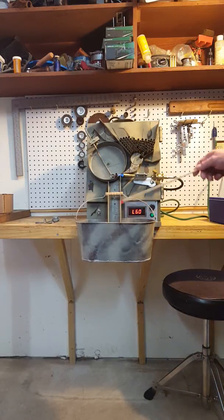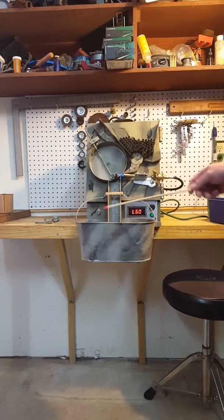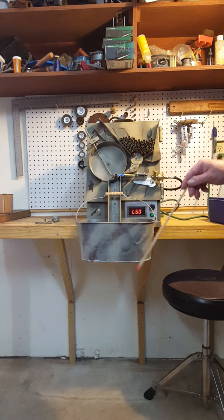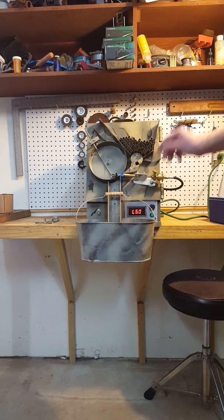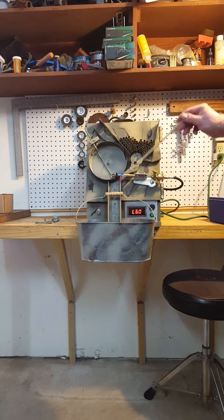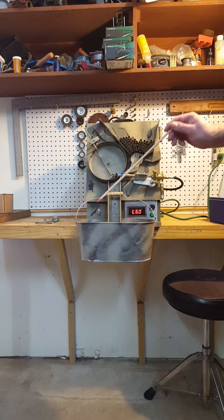You see this little steam coming up here once in a while. I've got some ripped-up towel in here with some water, so that when the case hits it, the heat does not migrate back to the head of the case.